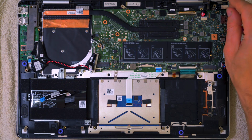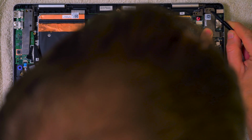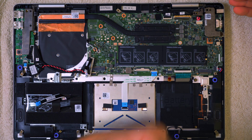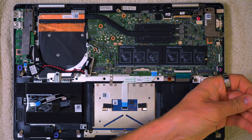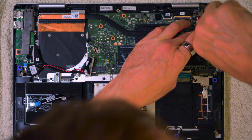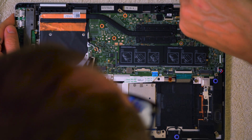So we'll go ahead and get this LCD mounting bracket on. There's a little locating bit of plastic there to make sure it's located. There's a corresponding one there too. So we'll get this one in first, but loosely, and then we'll get the others in. So this one here is a case screw. Yeah, loosely, not hard, just loosely. And we'll get this one in. A bit more firm. Check that one just lines up. It just lines up. I have to say it's a bit tight, but it does line up. Okay.